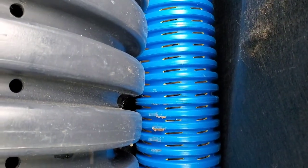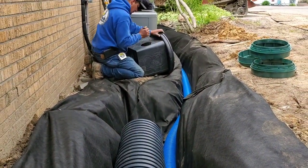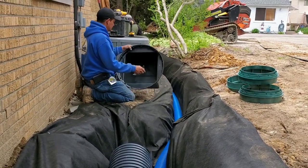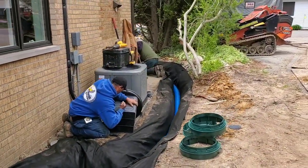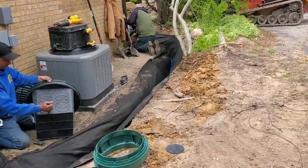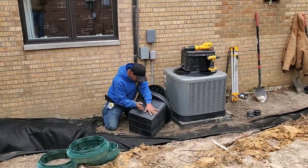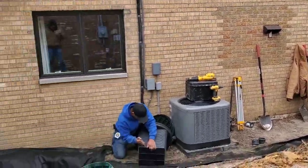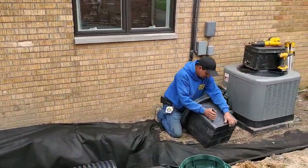You have the high-octane eight-slot — see how the chambers have holes? The water just floods into the sump pit, into the chambered system. You don't have to hook up any pipes. People are always struggling with this, asking where to hook up the pipe. That's the beauty of it — we built it so you don't have to. Always put a D-Box in for your roof runoff system because your roof is always going to be dumping leaves, shingle gravel, and debris. We're using a 20-inch round for that here, so the homeowner can go about their life and if they don't check it once every few years, they'll be fine.